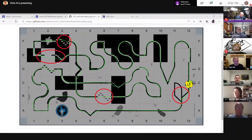In the terminology of Rodney Brooks, that would be called a ballistic behavior. Once you sense what you're looking for, you just pull the trigger on a behavior or movement, and once you start, you're just going to finish it. That's what I'm doing. I'm taking advantage of the fact that the course is known and very predictable. There's no noise in the sensors and so on. So I can get away with doing a fixed maneuver at that point, because when I stop near E3 or at that intersection E4, I always stop at the same place, same angle, same orientation. And so I can get away with a fixed maneuver to make it from E4 to E1.